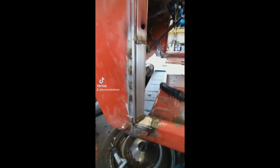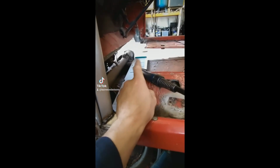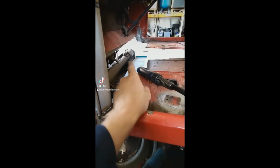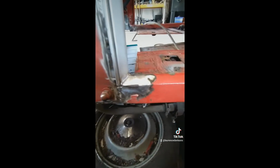So I got this bit welded in, wall welded in, sills repaired, gutters in, and the new A-pillars in. So I just need to clean the welds off, and then that bit's done. Then I can move on to prepping and putting the front of the floor pan and the front bulkhead in. That's it all cleaned off. I've got this side all done, this side's all done, so now I just need to move on to the inside. I need to cut along the top of this level, make this nice. I'm going to hack some of this, this is all going to take paint anyway.